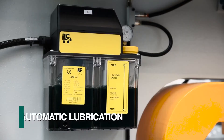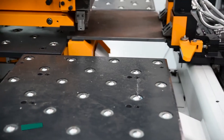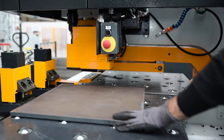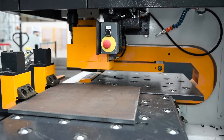A centralized lubrication system automatically addresses the needs in this area. Rugged material clamps that can also process angle are furnished to provide part positioning. Once the part is positioned into the clamps, the X axis zero stop retracts automatically.